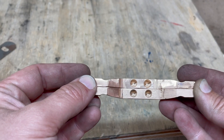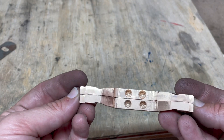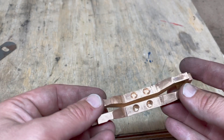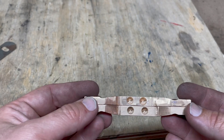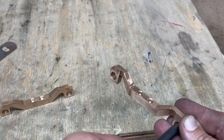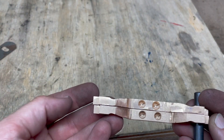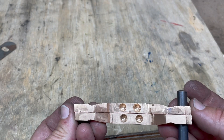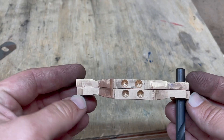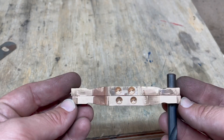I don't think that's going to be a major issue but it's quite annoying. In getting all these parts to be equal — the angles and so on — I just used the external faces as a datum. I didn't actually check where the marks were for the axles, so the whole thing is offset at an angle like that — another one of these parallelograms.